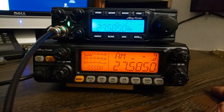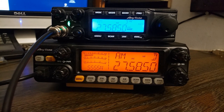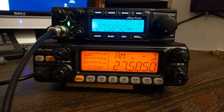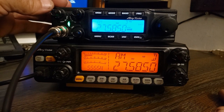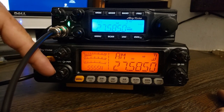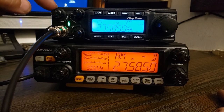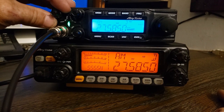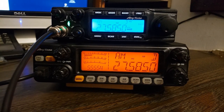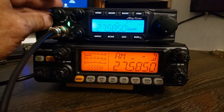Let's take that one and go up there — it's a 1.1. I was overdriving my amp. I had the radio on sideband setting. That was one other thing — they both have the RF power output adjustable. I was just sending about 7 watts AM dead key into my amplifier. Shame on me — one of these days that box is going to go poof.